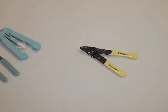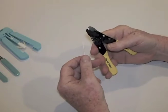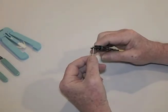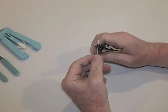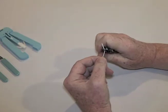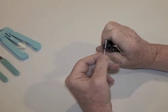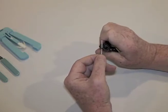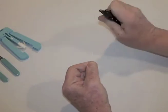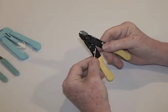In my experience, these Miller strippers are the most reliable strippers, but they're also the ones that require the most technique. You can't just lay the fiber in and clamp and strip it off, because when you lay it in, the fiber gets bent at an angle. So what you have to do is hold the stripper at about a 45-degree angle when you clamp on the fiber. Then you have to clamp very firmly and pull carefully, and it works very nicely. It's a very reliable way of stripping the fibers once you develop the technique.